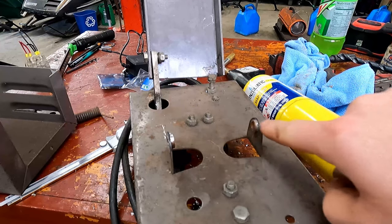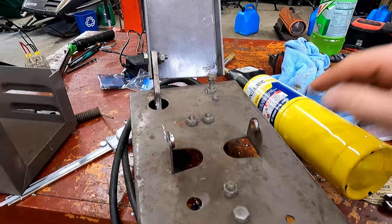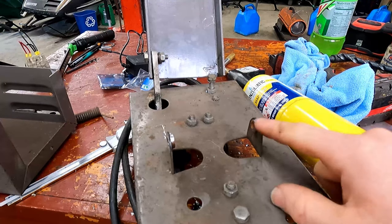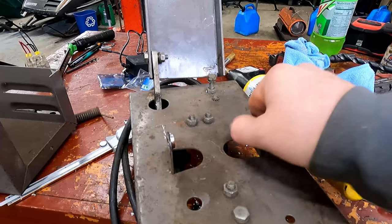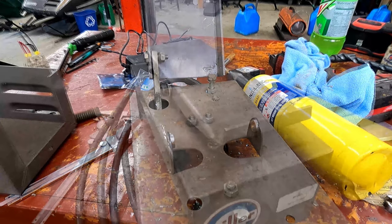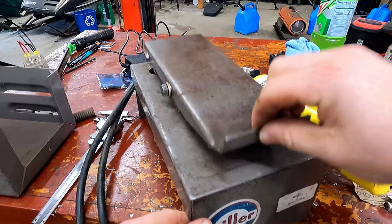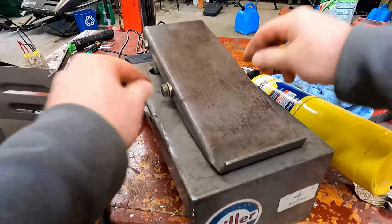And what I actually did is I soldered it in place. And you can solder steel to bronze. I'd say the only negative side of doing that is I would have preferred silver bearing solder over electrical solder. These will probably crack, but maybe they won't. So I'm not going to bolt it all together because I'm going to have to take it right back apart again. But what you can see, and these aren't quite fully pressed in, but that's also fine.